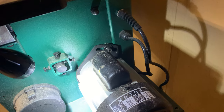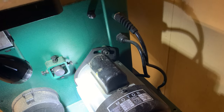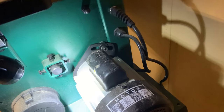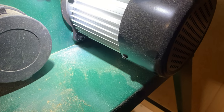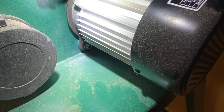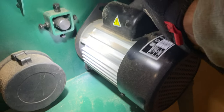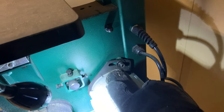The biggest change I made was adjusting the tension on the drive belt. The saw has two possible speeds that are set by the pulleys that the drive belt sits on. In order to make that change, the motor has two bolts you have to loosen to move the belt — one is on top and then the other one, you see here, is below the motor.